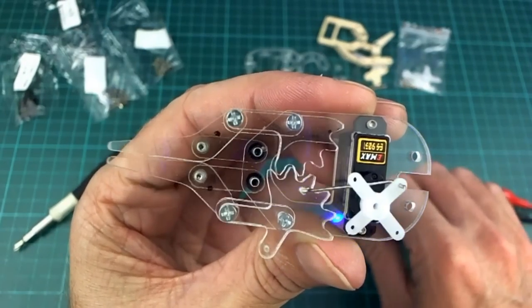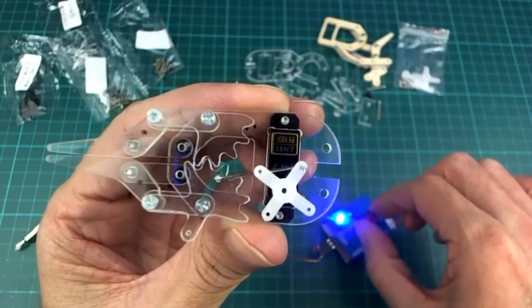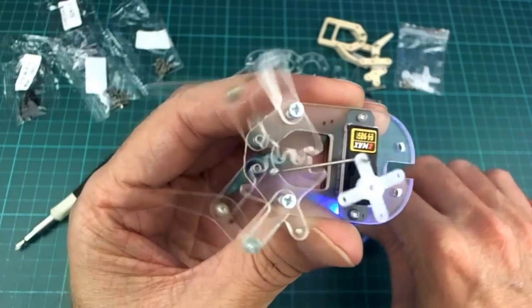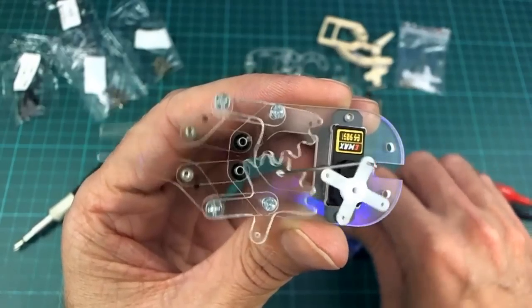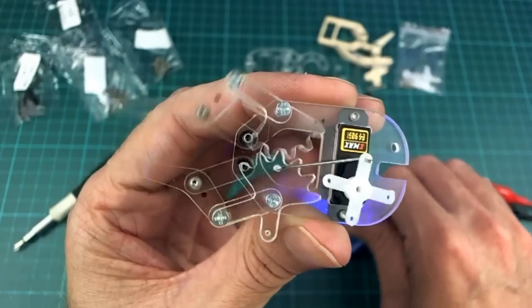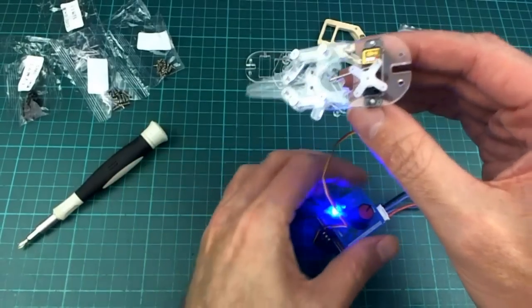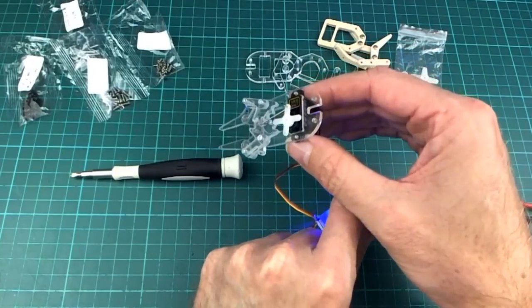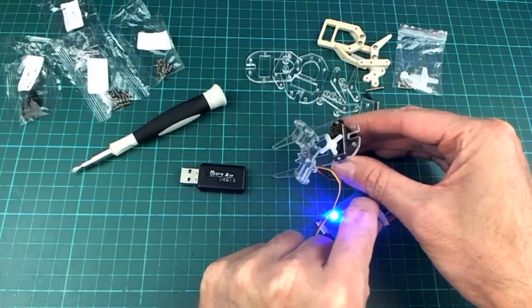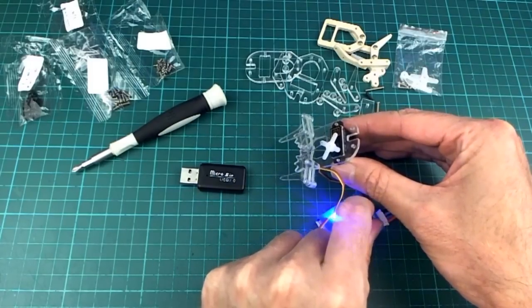Yeah, it looks like a little over 90 degrees, but whatever it is, it works out quite nicely so that the 1000 microsecond servo pulse and the 2000 pulse are exactly at each limit of the range of movement. So it's quite convenient. I won't have to calibrate my control when I'm opening and closing it. I'll just set it to 1000 to 2000. And it's not super strong, but I don't really need it to be. I wanted it to be able to pick up 2 centimeter cubes, so you can see it's easily going to open up to 2 centimeters.